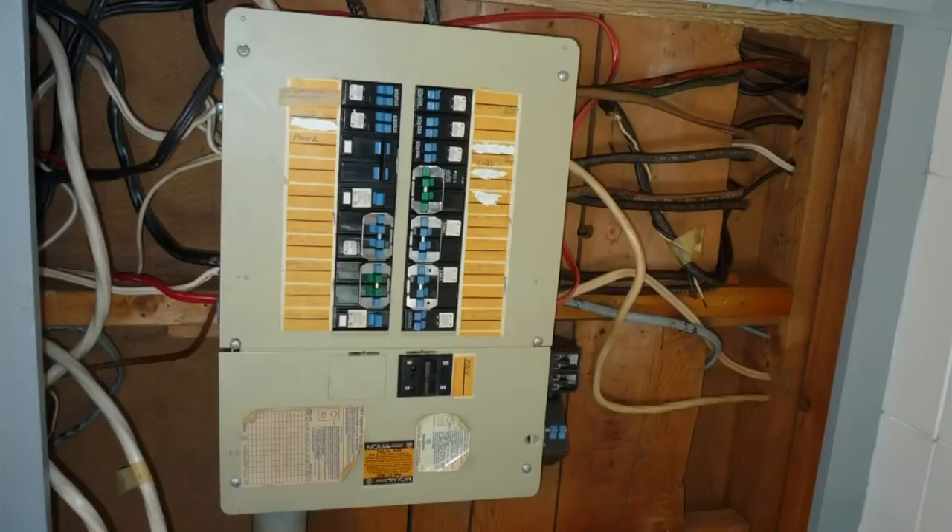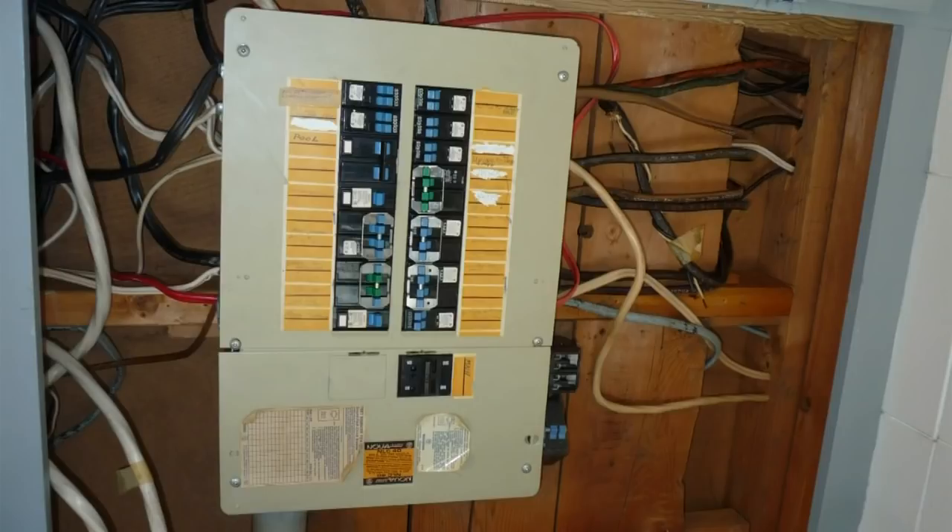Now we're looking at the electrical panel — the place you go when all your lights go out. One of the first things I do when I walk into a client's house is check the panel: 60 amp, 100 amp, 200 amp service? Breakers or fuses? I can normally tell if it's a home-done job or done by a professional. By code, after the wire leaves the panel it should be stapled at specific intervals and circuits should be labeled. If yours looks like a cat's breakfast and isn't labeled, people have been doing amateur work along the way. In my case I ripped out the entire panel because there was old aluminum wiring and really poor wiring throughout the house. I'm putting in a brand new panel and starting fresh.